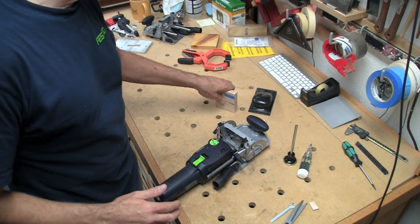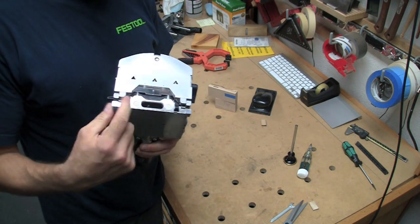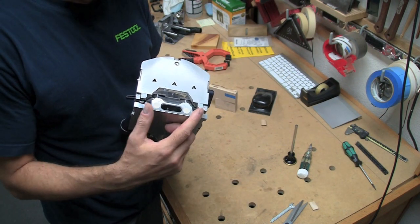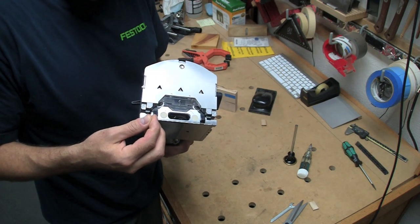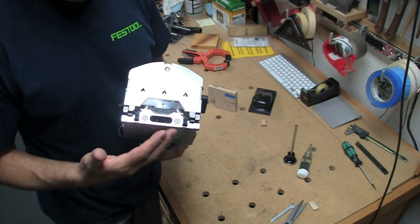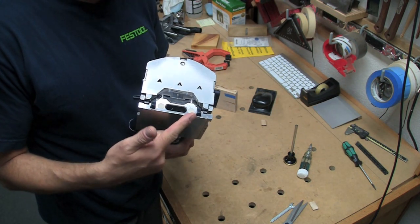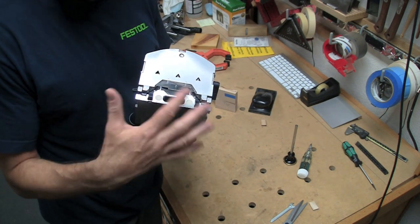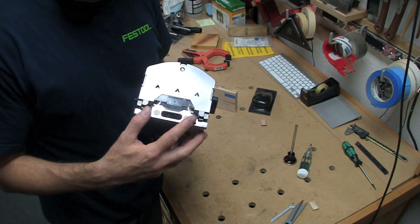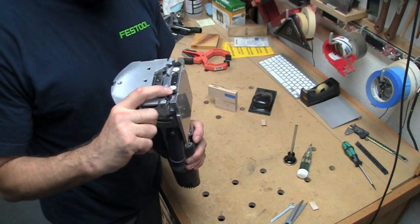Go ahead and adjust your Domino and you'll find it's a lot easier to use. Now this is a paddle model. There are some adjustments you can make to the paddle model for these two paddles to get them equidistant to the center. There are offset paddles that come with the full set — a left and a right — and the inside edge would be further out by six thou. You'd swap out whichever paddle you needed to get it closer. The reason it's six thou is: if you're two thou off you'd probably just lump it; if you're four thou off you could put the six thou adjustment in and be off by two thou; if you're six you're dead on; if you're eight you're off by two. So six works out as a really nice number to get you within two thou of dead center. You can take a look at Rick Christofferson's manual — he explains how to swap out these paddles individually; it's basically just a set screw on the side and being careful of the spring.